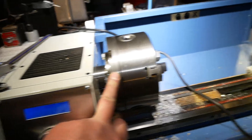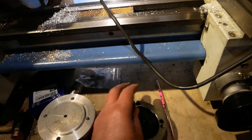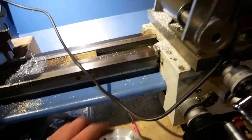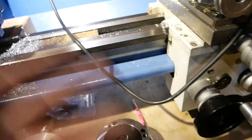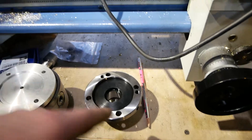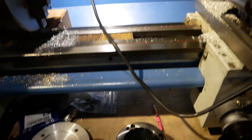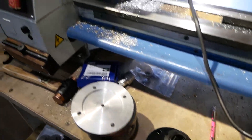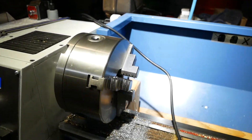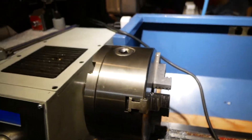And also in the center of this thing it has a shoulder feature, because that's the same shoulder that's here. So there is my collet chuck that I got when I bought this lathe, and I can put that same shoulder inside here — which I have duplicated inside there — bolt that down, and then that's highly concentric. The ER32 collet will bolt right down to this adapter plate. All I have to do is pull that off, bolt it right down, and then I can use the ER32 collet with whatever I want to do. That'll work super well.